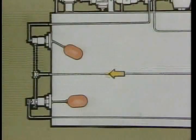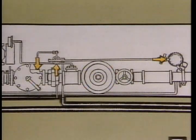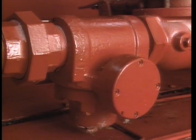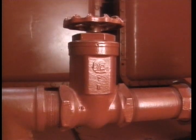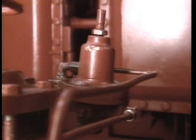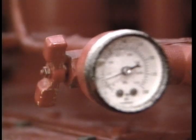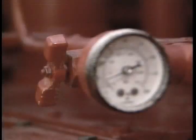The two-inch regulator control valve is a normally closed valve. It opens when the air control valve supplies it with air — this happens when the upper level fluid control switch opens, sending air to the air control valve and barrel pump. From here, pot water passes through the flow rate indicator, which tells us how many gallons per minute are entering the mix system. The final gate valve is the water rate valve, which adjusts the rate of flow into the mix piping. The barrel pump's stroke rate is controlled by a needle valve, so the water rate valve, water pressure regulator, rig air, and barrel pump output valve must all be in proper adjustment to maintain the correct mix ratio.